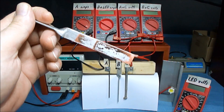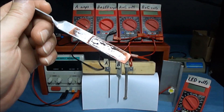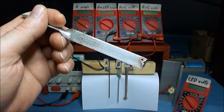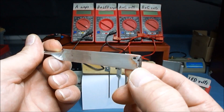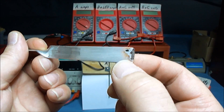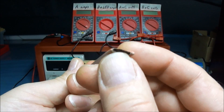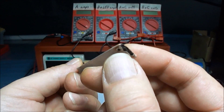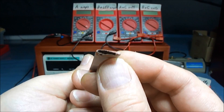This is an aluminum center electrode. You can see I've got copper deposits on the one side here — I scraped most of them off. On the other side, there weren't any copper deposits until the gas bubbles eroded the bottom away, and then it started creeping across to this side with some copper. But you can see there's a thickness there where the action was only taking place on one side, so there is a separation layer there.